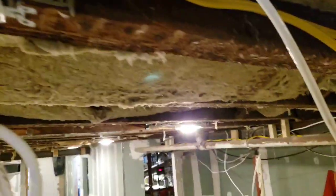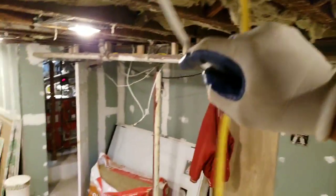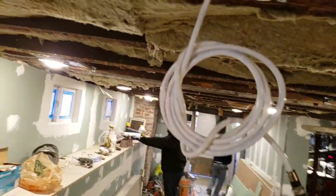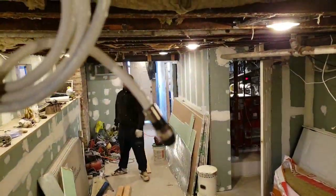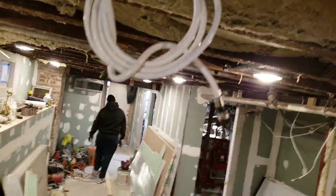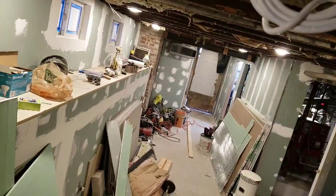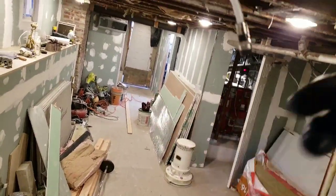So we ran it in up over. We're going to go into this outlet for a TV hanging from the ceiling, which is only a circuit with one outlet — another outlet over there for the TV. In the city here, you're allowed 12 outlets on one line, so this will only be three. I'm just going to connect it in here. We're not using the red — we're using the black, white, and the ground. Ground goes to the ground of the outlet, giving the box ground. And black to black, white to white, with a wire nut. That's it.